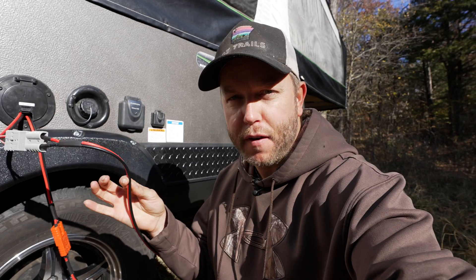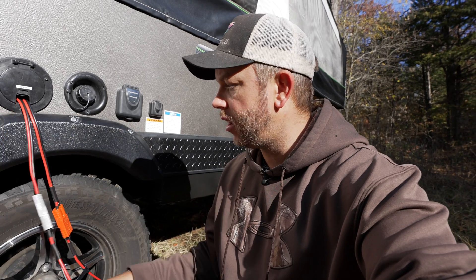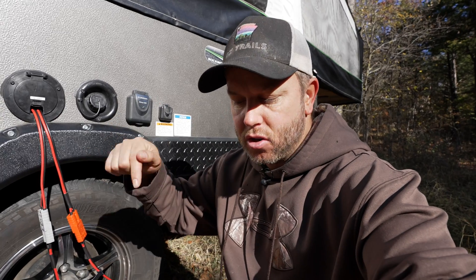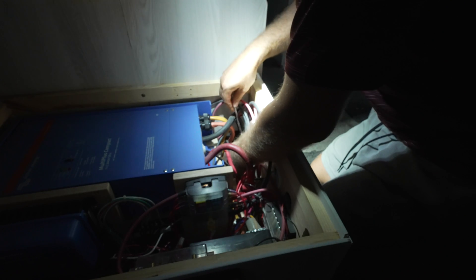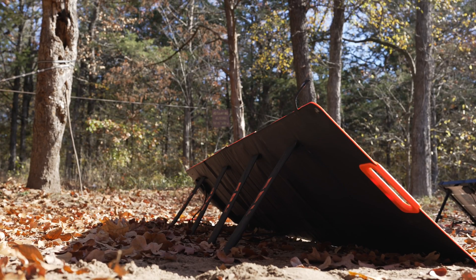I have 40 to 45 feet of 10-gauge pliable wire for each solar panel — highly recommend this. I'll have all the links to the parts I use down in the description. After installing the charge controllers I wired it up, connecting the red to the positive bus bar and the black to the negative on my camper. Once you get power, this is a good time to grab your iPhone and download the Victron Connect app, then connect it to the Bluetooth charge controller. Now that we're at camp, it's time to test out this 200-watt portable solar panel.